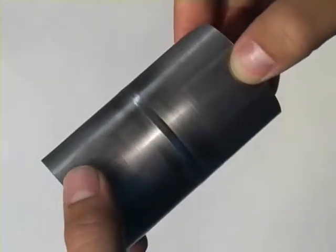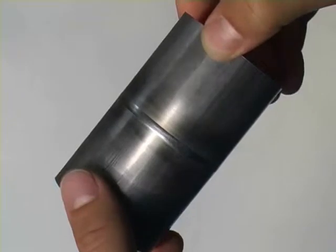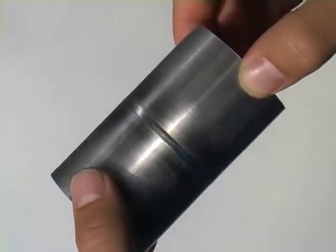After the pipe has cooled down in an internal gas atmosphere, the weld head can be opened and the weld seam can be controlled. Due to the constant flow of gas during the welding process, the weld seam is nearly free of tempered color and the inside of the pipe is a flat, smooth seam.